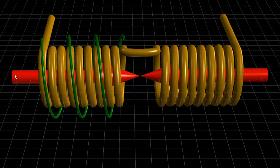Your input coil would have a magnetic field that opposes this red arrow here. If we were to pick this red arrow up, move it over here, and point it the same way it's already pointing, then this would be the magnetic field vector direction of the input coil. So this coil assists, and for every amp per turn, or every amp per square meter, that this coil adds to the system, because this coil is a source of energy, as long as it's in the proximity of a magnetic field changing in time, it will assist your input coil, bringing your input coil current down.